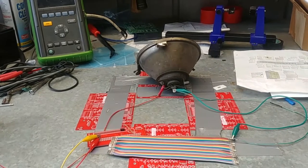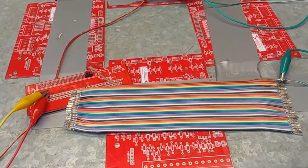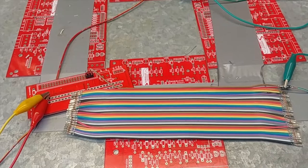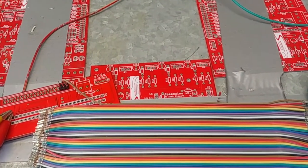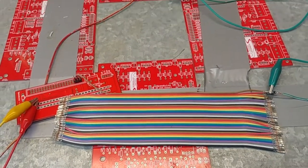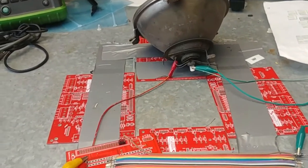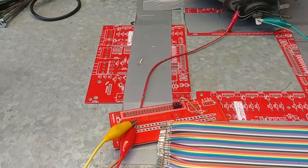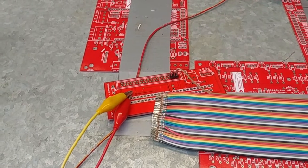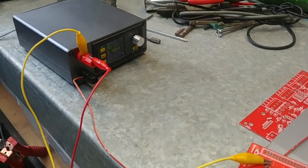Here I have a quick and dirty test rig set up. I'm using a single DuPont cable, fairly typical for what I would recommend using with a V0.4 board. In this case I'm only testing a single strand along that cable, so just one channel. I have an old headlight to use as a load source, just a little adapter board which I'm running the current through as well, just for a realistic sort of scenario over a PCB. And I have just a power supply as well.